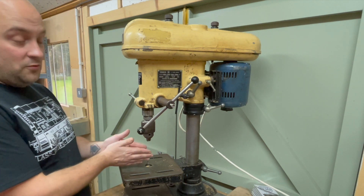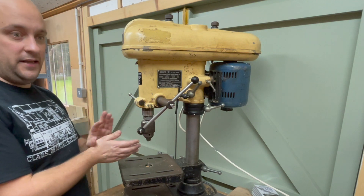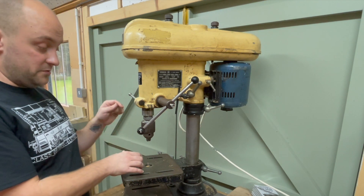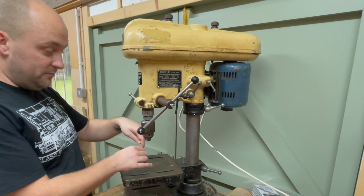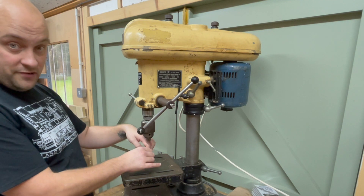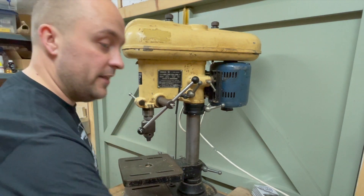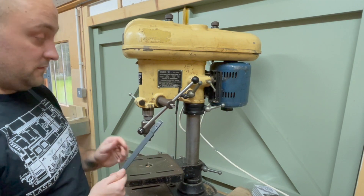Once it gets started, although the bearings are worn, it does drill straight and doesn't go crazy when it's in the hole. The challenge is getting that first hole drilled. So what I've been doing is using the centre punch and then a really tiny, almost flexible drill bit — so whatever the chuck is doing, the tip of the drill bit is definitely in the centre-punched hole — then go a bit deeper, swap to a slightly larger bit, and go deeper again. That's how I ended up drilling the pilot holes for these 1/16th inch rivets.